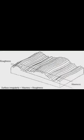As you can see, when I drop the water it immediately sticks to the surface. The surface tension of the water does not allow it to move. The water sticks because the metal surface looks like this, and after the soot deposition the metal surface will look like this.